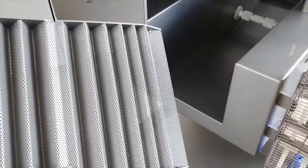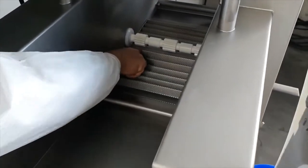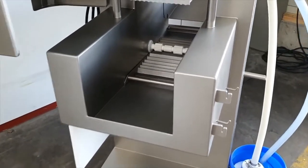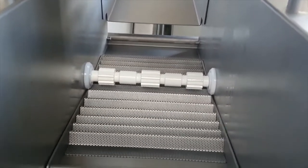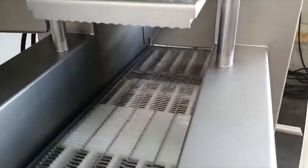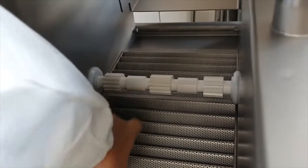Now you bring back in the filtration system — make sure it really sits in the middle of that machine area. In this sequence we are showing you how to put back in the transport belt into the machine. Make sure the end of the transport belt is beneath the infeed slider, and that this round area sits exactly on top of this plastic roller bar.